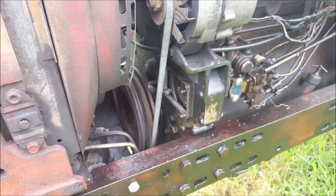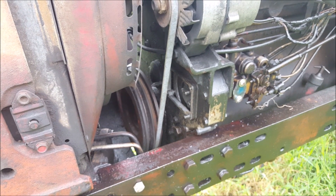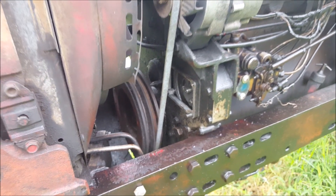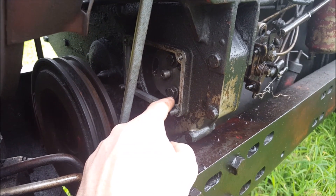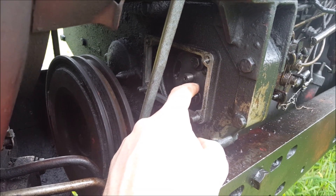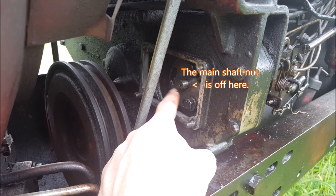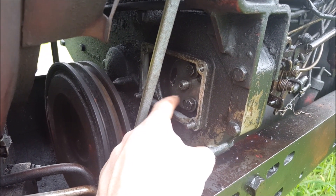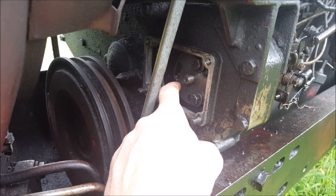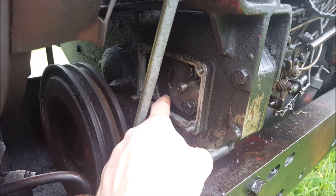If the silver line is not right above that little indicator, you need to adjust it. That would be done with these three bolts — you would loosen them and you can actually rotate this plate a little bit. This plate spins inside of the drive gear right in the middle of it, so you can adjust it a little bit one way or the other without moving this gear.